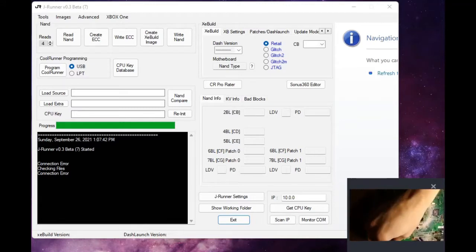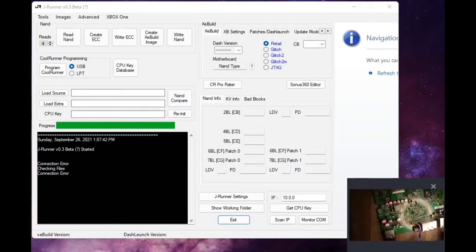We can close our little reference image because we installed that. First thing you do is you can click this little question mark and it will query your flash config. And if you've done a good job installing and soldering, you get a valid flash config, which is 43000.